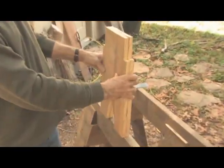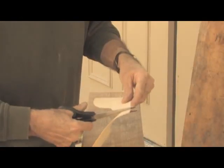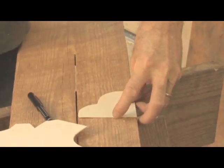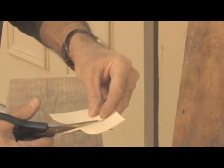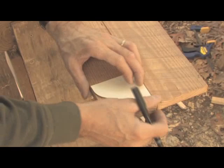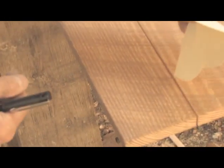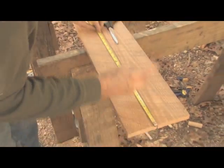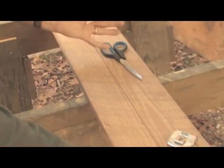To make the stretchers, I start with a circular saw and ripping guide. To avoid leaving cut marks in the sawhorses, you'll need to keep adjusting the position of the material and saw during the cut. Mark the decorative curves on the end of the stretchers using a folded cardstock template — fold a piece of paper in half and cut out the shape. You may find it's often easier to design with scissors than with a pencil, and if you don't like the design, cut again. I want to keep the natural edge as much as I can in the finished bench, so I use that cut line as my guide for the template.